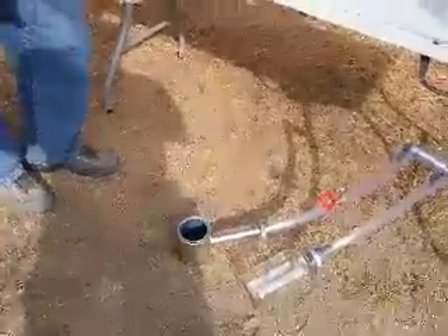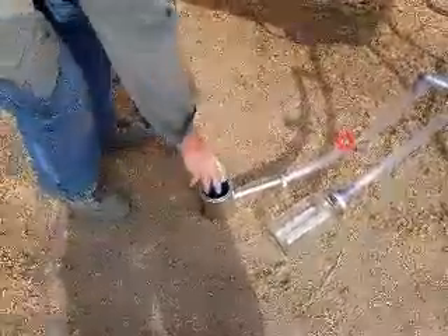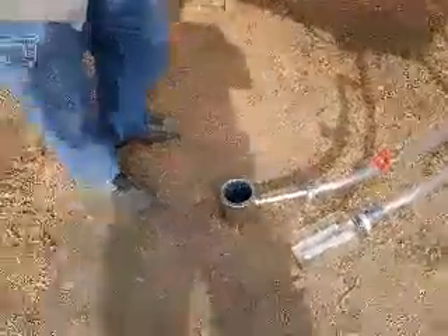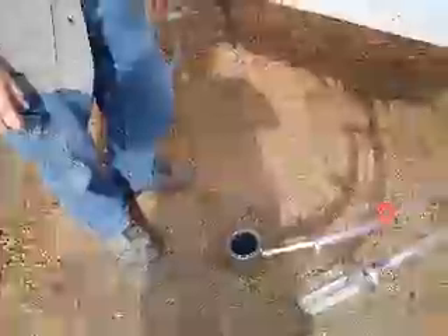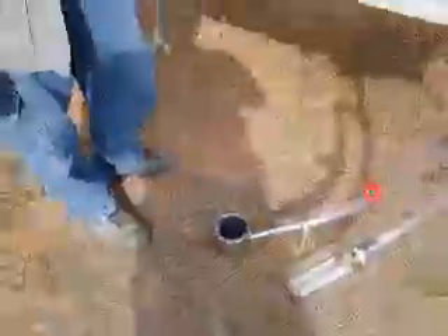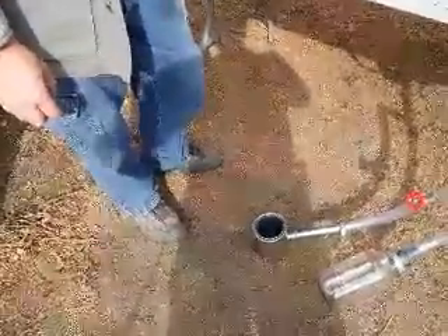If you put a torch to it, initially it won't light. But about seven to ten minutes in, you'll be able to put a torch on there and the smoke will stay lit — that's the point at which the gasification is running. If it's really dry wood, you may be able to light it in as little as six minutes. If you're relighting the system where you burned just part of the wood, it'll gasify in as little as two to two and a half minutes. If you're reburning wood that's already in there, you don't need to wait seven, eight, or nine minutes.